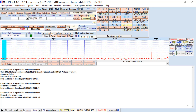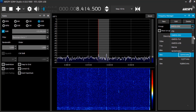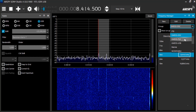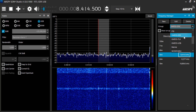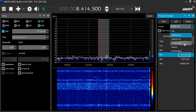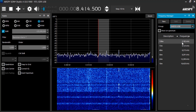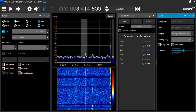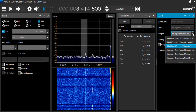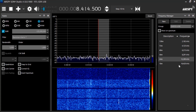I've also got the frequency set up in SDR# for GMDSS in telex mode and USB mode. These are not emergency modes but communication modes. Let's go into USB and take a quick check. I'll stop this, bring the audio back on speakers, and we'll do a quick check to see if we can hear anything.